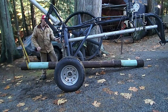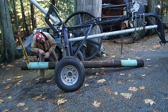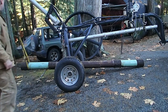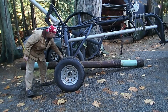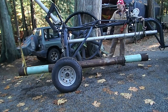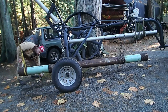The arch seems happy to pick up four or five thousand pounds if the majority of the weight is held under the actual arch and directly above the axles, balancing that as the center point of the mass you're carrying. It also keeps all the dirt, rocks, and pebbles out of the bark of your logs so you're not ruining your blades — and it's a far more efficient way to move wood than skidding or dragging.